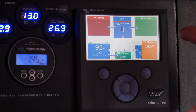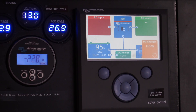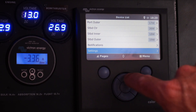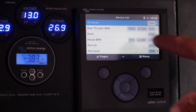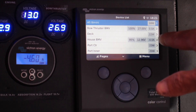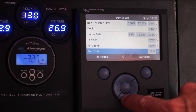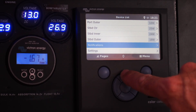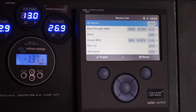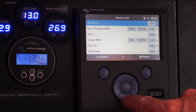Like I mentioned, we don't have the Victron inverter, but I do have the inverter on, so it's all rolled up into this DC power number. I use this for monitoring solar. If I go in, I can view a couple of menu options. I've named each one of the controllers — our aft bimini panel is getting 18 to 19 watts right now. The deck solar panel is at 15 watts. You can see a couple of other solar panels — port center, port inner, port outer — about 20 watts each. It's not great output because it's a cloudy day. I can also see the two BMV devices listed: the house BMV and the bow thruster BMV. You can drill in to see all the detail. If I'm getting zero watts out of a solar panel for the day, I know something might be wrong — a wiring issue or a controller issue.